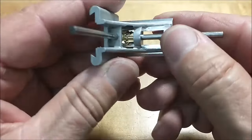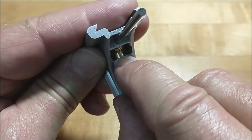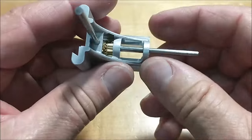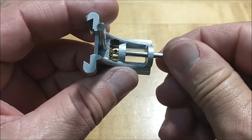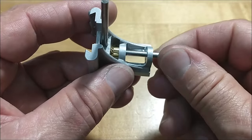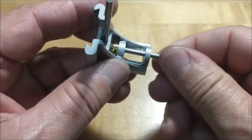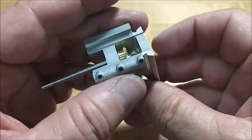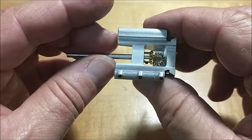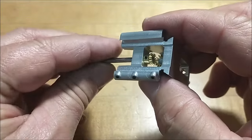Modification that I will make, I'm going to remove 20/1000 of an inch, half a millimeter from this surface here where the gears meet, and this surface here where the gears meet. And I'm going to replace that material with a Teflon washer or a Delrin washer, so that I can take that brass to aluminum face-to-face rotational friction out of there. Not that it has to be, but it's my model, and if you've watched my channel for a while, you know I go the extra mile on stuff like that. I just don't like rotational faces hitting each other.